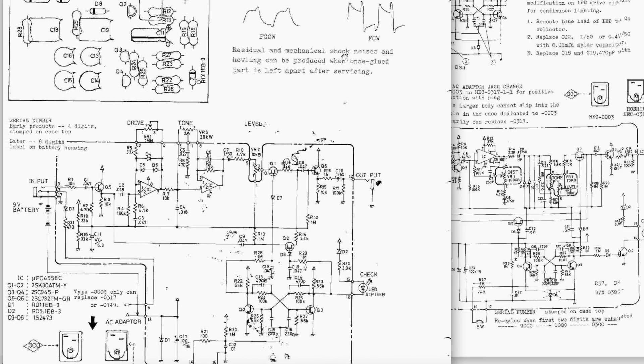As you can see, we go through — so this is the input, this is the signal that goes through here — into that buffer, and then it exits the buffer and goes into the op-amp. You have clipping diodes within the op-amp feedback loop, so it's soft clipping. You're getting controls right there, which is normal, and then a low-pass filter after that. The sound exits and goes into the next op-amp stage, which is your tone control.